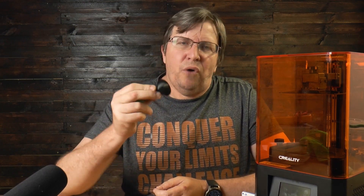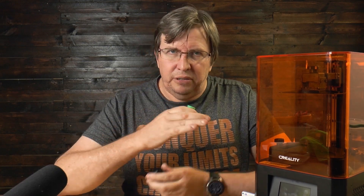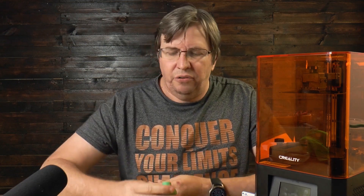I sliced this one in Cura and printed it on my Ender 3 with 50% infill — came out to about 2 hours 50 minutes. This one was printed on the resin printer and was about 3 hours 14 minutes. I did a calculation on the cost based on how much the roll of filament and the bottle of resin cost and how much we actually used. The FDM one works out at around 75 US cents, and the resin one at about two dollars — quite a lot more expensive. But the resin one is a lot firmer; it's completely solid, whereas the FDM one has 50% infill. On the resin printer there's no infill because you can't really do infill on resin printers.